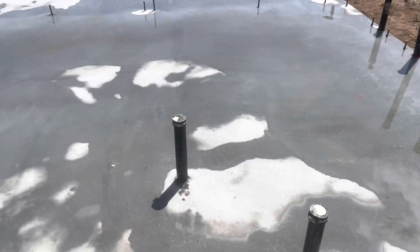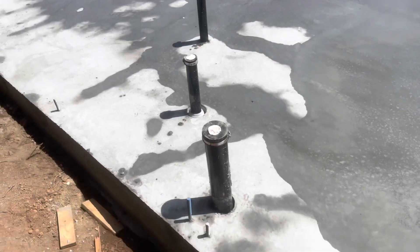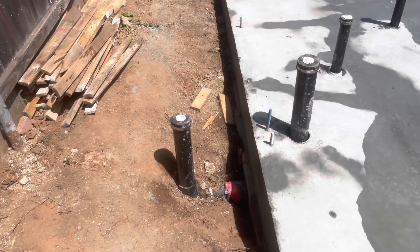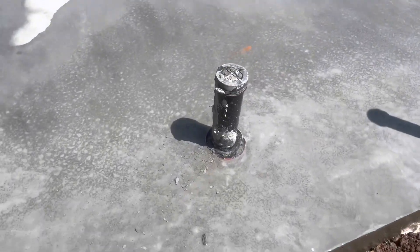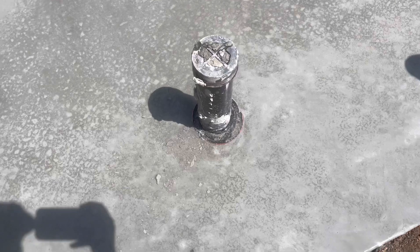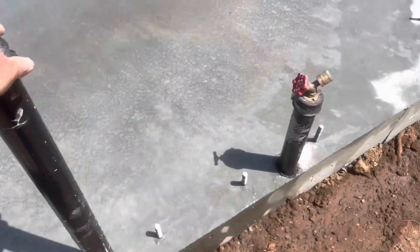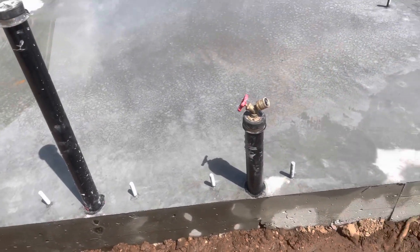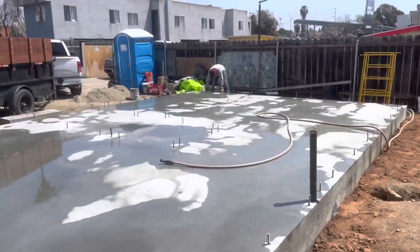This is the final foundation, all stripped. We've got our plumbing here — a vent in the wall for the showers, bottom and top floor. That's the drain and vent for the upstairs toilet. Our clean-out is right here — it's the end of the line where they can snake it if they need. This is our downstairs toilet, and this is the foam that we have — wrapping the foam extra thick so you've got about three-quarters to an inch all the way around so you can move it. That's our vent for that toilet and the vanity, and also the drain. This is the washer and dryer in that little closet, and then there's our kitchen.